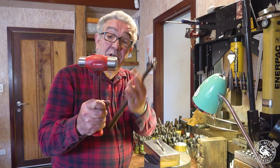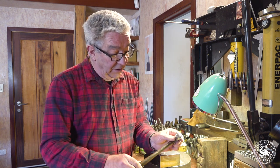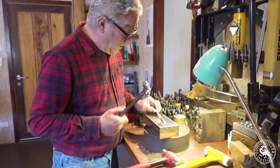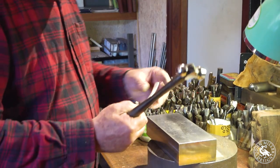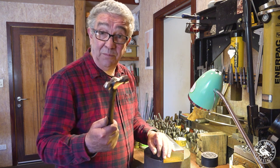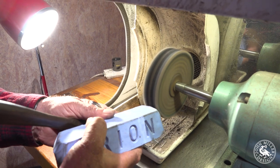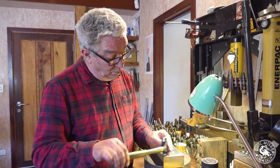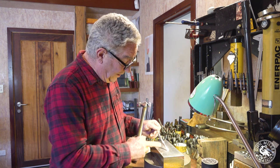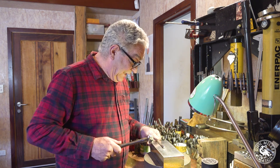I'm pulling down my profile because I haven't got much curve on here, and it's starting to bite in at the edges. So I've got myself a nice polished hammer here with a reasonable round profile on it — a good sort of radius. I'm working on a nice clean steel block with a nice polished hammer. It's a fairly standard ball-peen hammer, but I've put a nice polish on it, and a final polish with a product called Steel Bright, which is tin oxide. That gives you a really nice shiny hammer. It's good to dress it occasionally as you go because it gets a bit pitted. This will give us, in effect, a really nice finish so you don't really have to buff or polish it later.